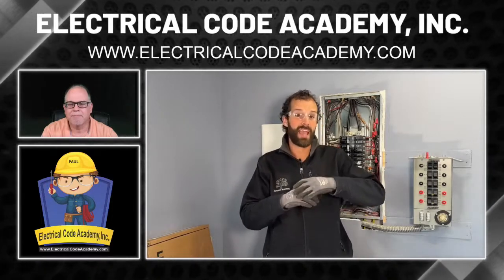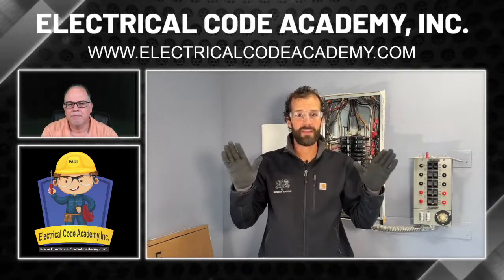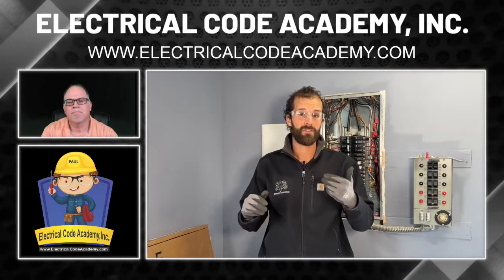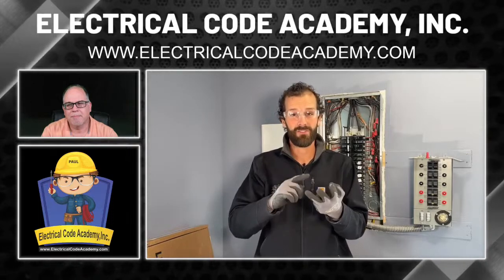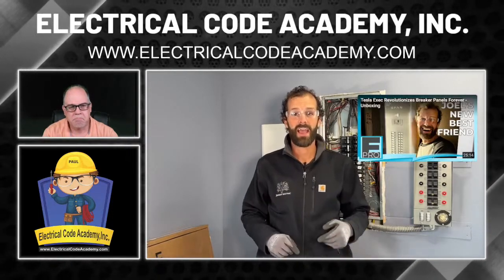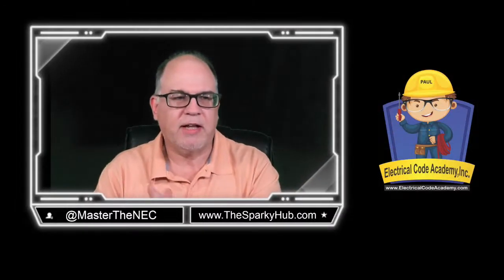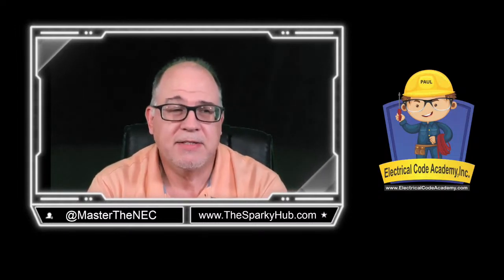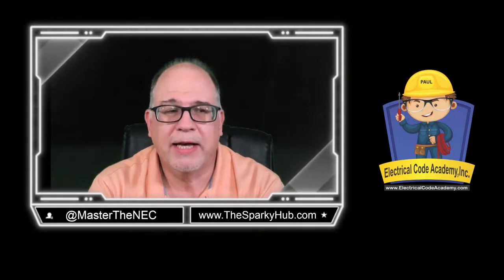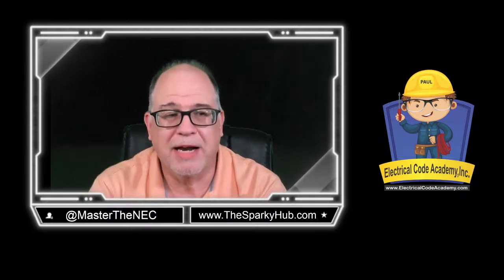Combining circuits is so common — at least 50 percent of the jobs we do — because of the ever-increasing power demands in a home. One component I think every home will have in the next 10 years is a smart panel. Now let's think about the follow-up. You can do splices in a panel — perfectly fine. He liked to use Wagos, but again, I'd cut off the compressed copper piece that came from the breaker terminal — that's my recommendation.